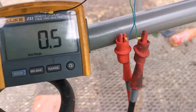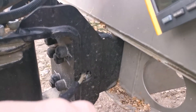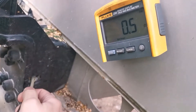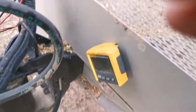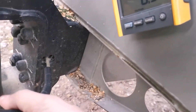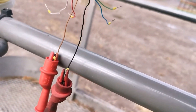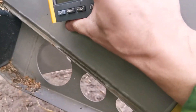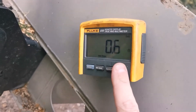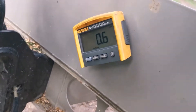So next thing I like to do with this resistance is to have my meter connected, and I will move the wire here by the entry to the load cell, and just move the wire to make sure there's not a loose connection or something. By moving the wires I'm just looking at the resistance to see if that's gonna change or not - and that shouldn't change at all. So if you have changes when you move the wire, that's most likely a problem with the wiring, maybe inside the load cell - maybe it's been caught and something has been pulled out. I will do on the single pair the same. So I moved my clips onto the brown and black pair, and while I'm reading resistance here, I move the cable around just to make sure everything is okay - the resistance doesn't change, which is good.